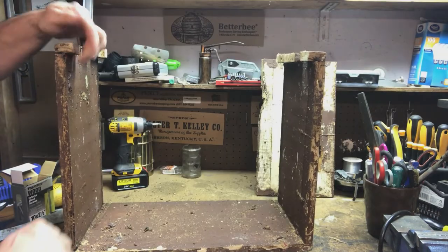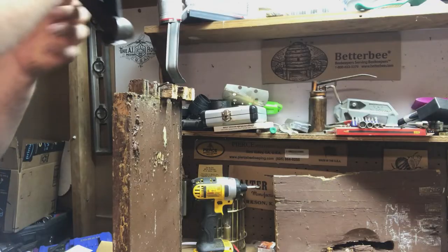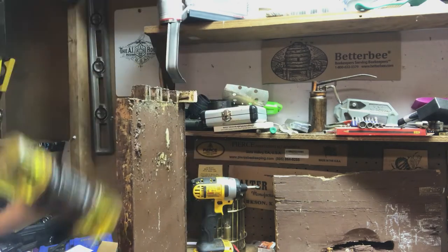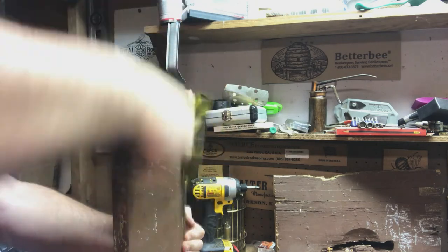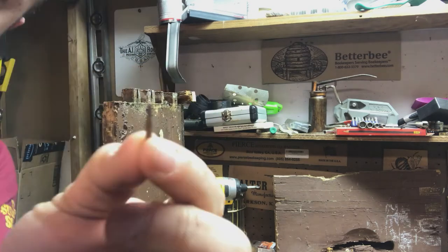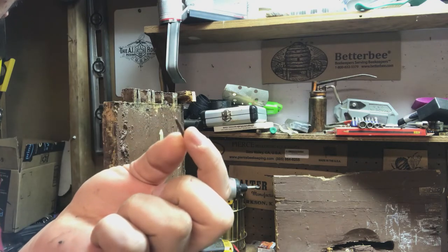All right, here we are. We can pull some of these things out, and we'll be doing that in a second. Let's take a look at that board. See that the rot is just so nasty. I'm going to try to free some of these up. And the teeth left over aren't exactly going to be beautiful either. But let's see what we can do. Let's be forceful and tap it with a mallet. There we go. We burst it, and we just want it up enough to where we can pull the nail free. Now here's a good example. See this nail that snapped off on the other end? When it's right against the rotten wood, it starts thinning the side of it and rusting the nail down.